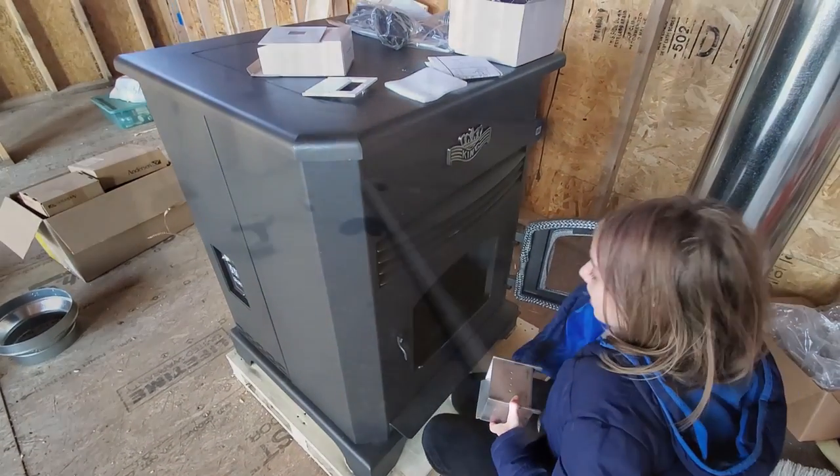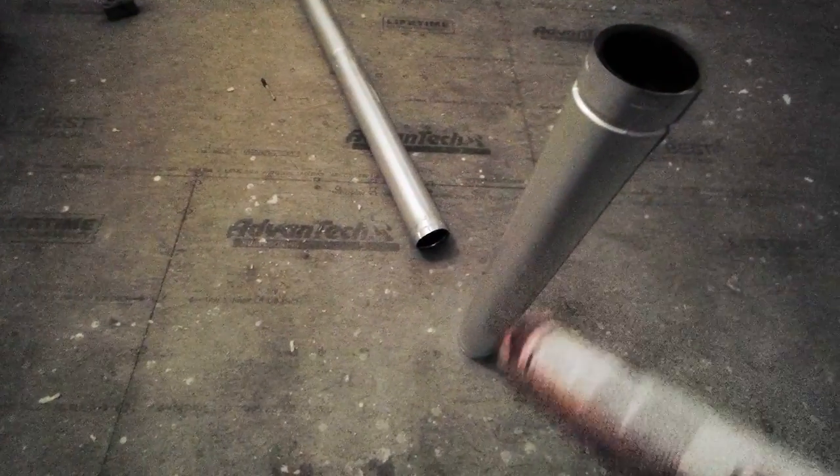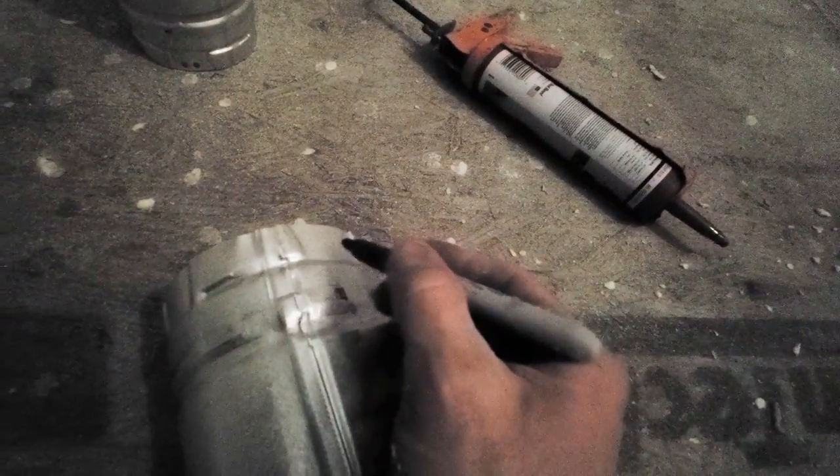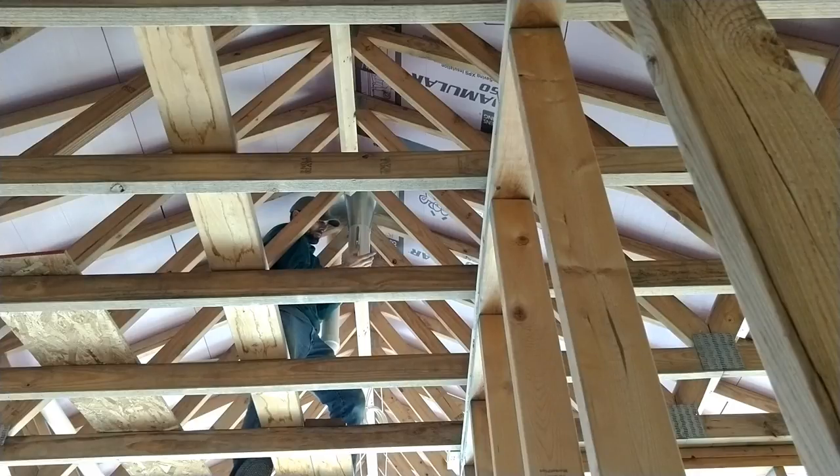I've got a 14-foot pipe hooked together. I'm putting high-temp silicone around the seal here, then marking on the pipe exactly where the end of the screw portion stops to make sure I get it in all the way. The little tooth comes in and slides all the way over, so I'm putting a line down so I know it's 100% locked in place. These don't go together very easily, so this way I know it's fully seated. The silicone gives you your air seal.